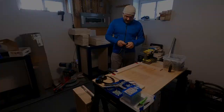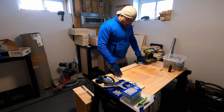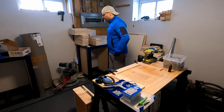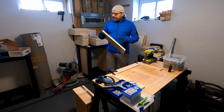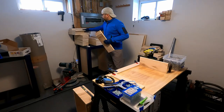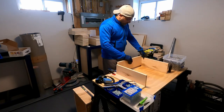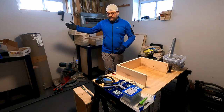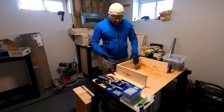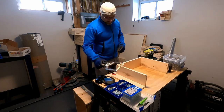I created a right-angle jig on two sides where the width is the exact width of the drawer. Having a jig always helps create square boxes and ensures repeatability. Two sides go into the jig and the piece with the pocket holes goes on the outside. You won't see those pocket screws because there'll be a false front, and the back side faces away inside the cabinet. The pocket screws go on this side so the screw goes into the middle of the wood rather than trying to grab from the edge.